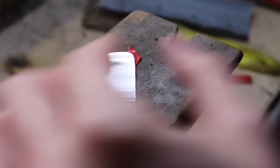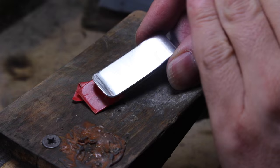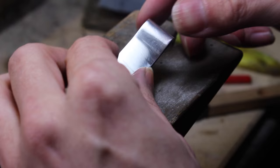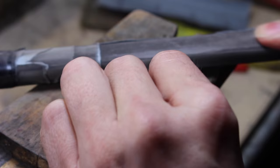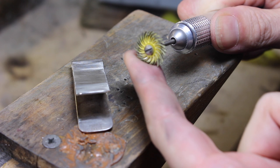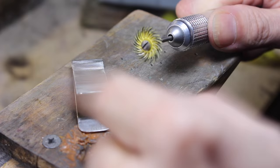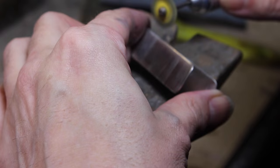So just a little bit more work with the buff stick here. That's all the engraving disposed of and the surface is nice and flat now. It's important that it's flat because when you polish it you'll get undulations. The back's not too bad — just a couple of little scratches — so I'm going to go over it all again with the 500 emery buff stick. Filing, sanding, just making sure the whole thing is flat until we get rid of all the scratches. Here I've got a little 3M Scotch-Brite wheel, so I'm going to get inside the piece and go all over it to give it a nice satin finish, being very light where the hallmark is. Using that I can really get inside there and polish right into those hard-to-reach areas.